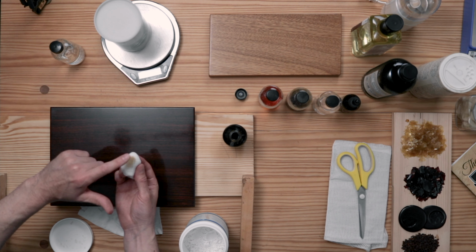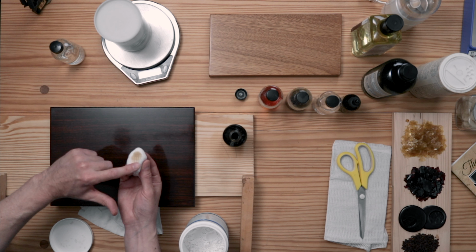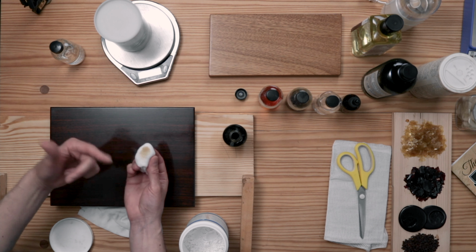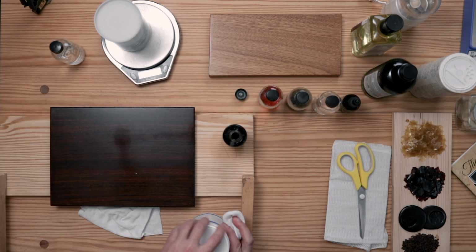It takes the pumice, which is white, and it's gonna turn it clear. But the reason I wanna turn it clear with shellac is because the shellac will keep it clear. If you just turn it clear with alcohol, then eventually that alcohol is gonna go away, and that's how you end up with white pumice in your pores sometimes on accident. If you've ever encountered that, it's not fun.